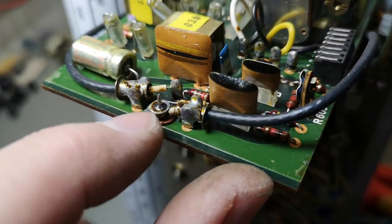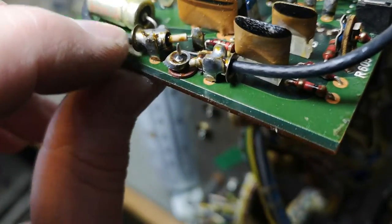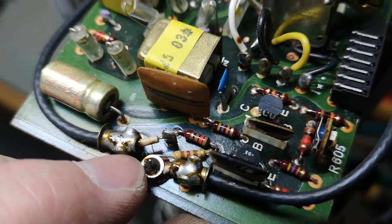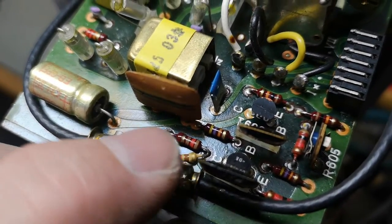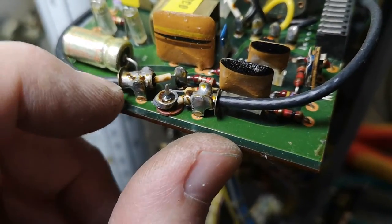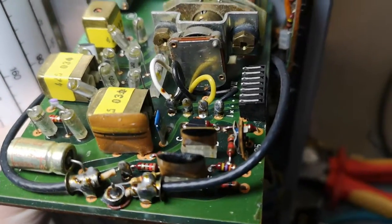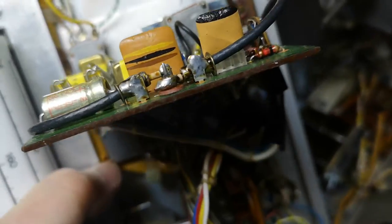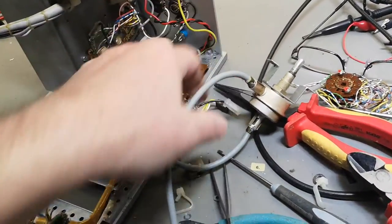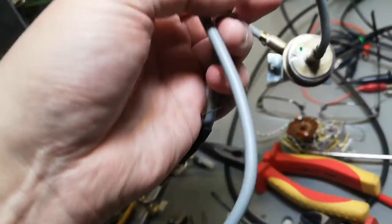This is the center of the modulation output — this is a feed-through capacitor connected to the outside, and then the pin is actually connected to the PCB ground. So they're using this capacitor as a decoupling, and then there's a resistor to something. Isn't that just a little bit the other way around? But hey, if it works it works. I think it's the first time I saw this one. And of course I got it out without cutting the cable too much — I nicked it a little bit with the angle grinder but of course it was easy peasy.